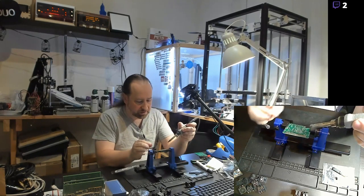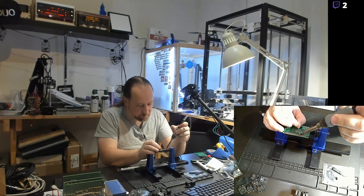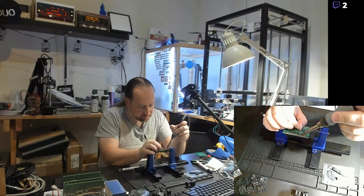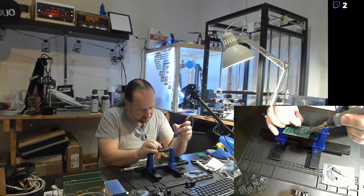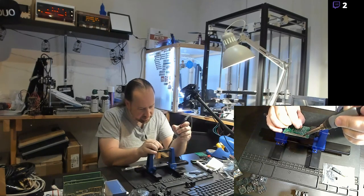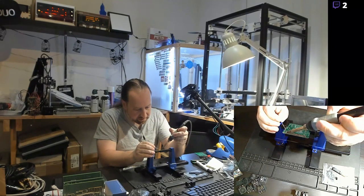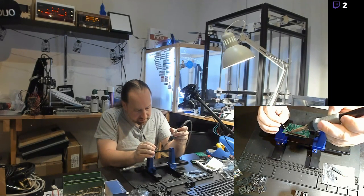So when you're soldering things in like IC sockets, you've got to flip the board over after you put the socket in the board. And of course, you've got to either hold it or flip it over so that the desk holds it. But if you have a little bit of Blu Tack putty, you can just drop that on there. It will actually sit on top of the socket and hold it in. Nice, quick, cheap idea.